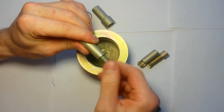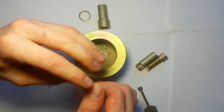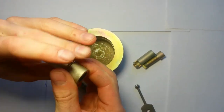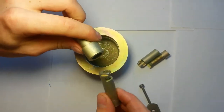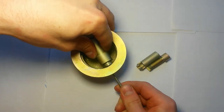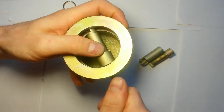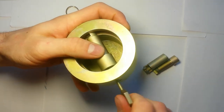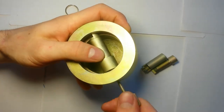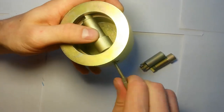The principle of operation is based on the wedging of the screw pair inside the housing. The bushing is inserted into the hole. The secret mechanism is inserted into the bushing. Then everything is closed by the case. The key pushes the secret mechanism all the way. The nut is fixed in the slot of the housing with its outer grooves. Now it is possible, relative to it, to unscrew the screw by the eccentric.